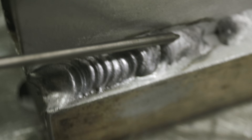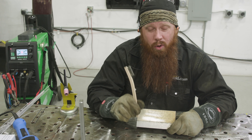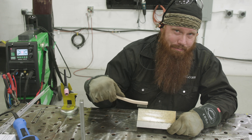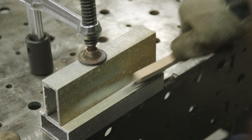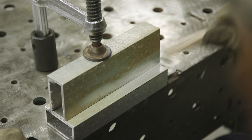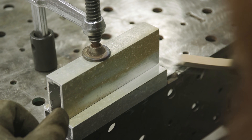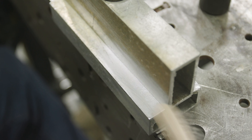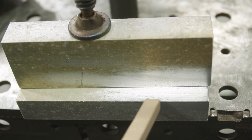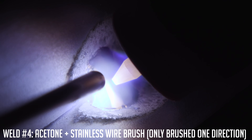Now I'm going to clean up the first half of this plate using a handheld stainless steel wire brush, but this time the right way. I'm going to brush in only one direction — pull everything off, make sure all the debris is pulled to the side, and not go back and forth so I'm not cramming oxides back into the striations of the material. I'm also going to clean the surrounding area, about three-eighths to a half inch away from where I'm actually welding, so the arc doesn't pull anything into the puddle. That one turned out pretty good — a lot fewer contaminants, floated a lot better.